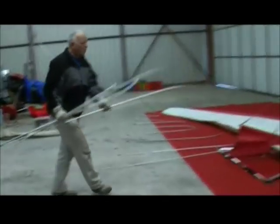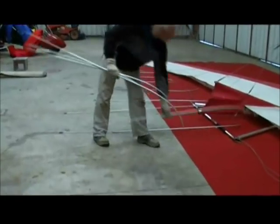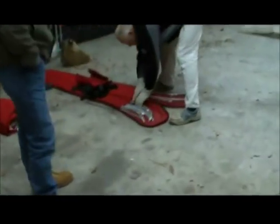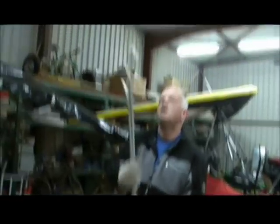Now, I'm on the right wing, so the principle's the same. Longest batten to the centre, second longest, third longest, etc. Then back to the batten bay, and then 6, 7, 8, 9. Same again. Ignore the red one, that's because the previous owner had put a wrongly coloured end in. So you take the longest, and you continue. 6, 7. Okay, the others for the moment I ignore. I leave those there, and I'll go back and stop putting the battens in.